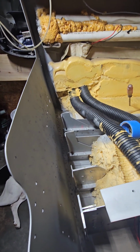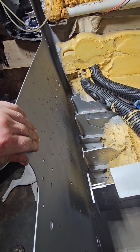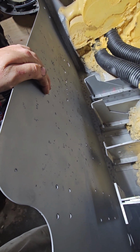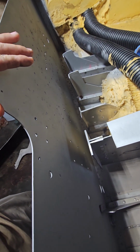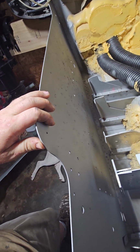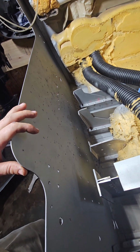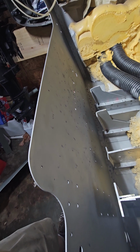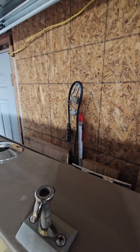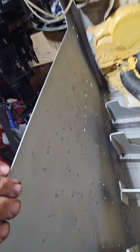So the idea is, if I can afford it, just put this in here, burr these, grind all these out, and I'm gonna alodine the whole area that's affected with it, and hopefully that takes care of it. I acid washed all this already and picked out all kinds of corrosion as far as I thought it would go, but I just want to be safe and get it down to fresh, bare aluminum and weld it full of some kind of aluminum stick weld, like that little contraption right there, oxyacetylene little deal, just welded in there. Braze, that's the word I was looking for, brazing.